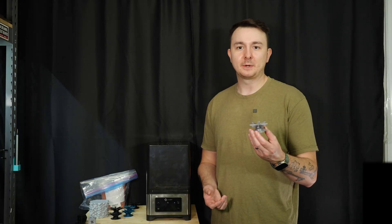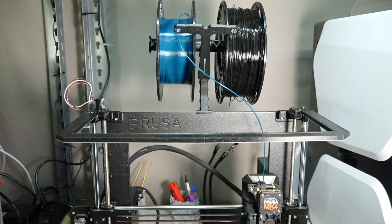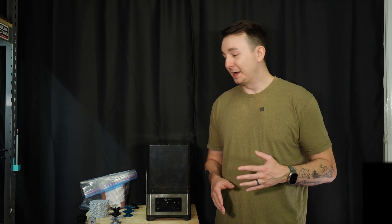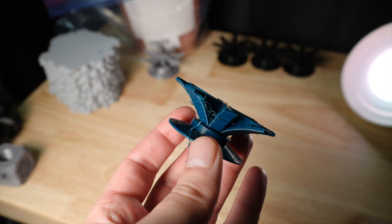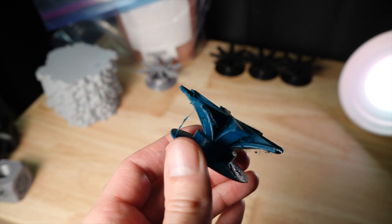So that is a success in terms of the dryer, although it wasn't quite what I was expecting. On to desperate measures — I dug into my closet and found a really old roll of PETG, which gets wetter faster than PLA and will suffer more from being wet. This roll of filament is probably about a year and a half old. I used it to make the enclosure for my Mark III and it hasn't been dried since. It's been sitting in a container with desiccant, but it's just been sitting there getting nice and humid. So I ran one print with it and it looks like crap, and it's exactly what I was hoping for. Wet filament really will cause your prints to look bad, and this is the perfect example of what I'm talking about.